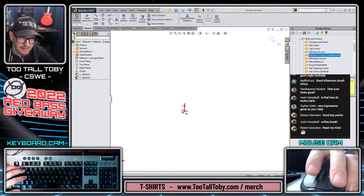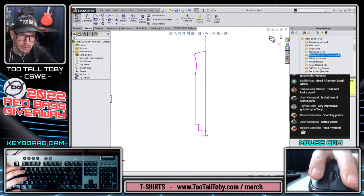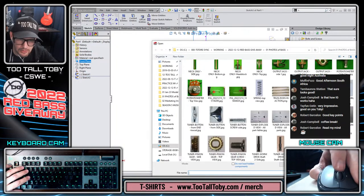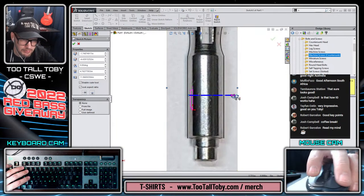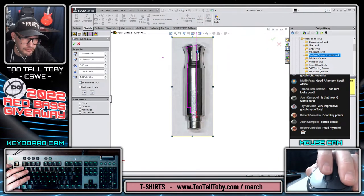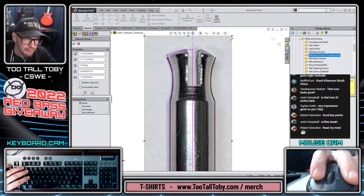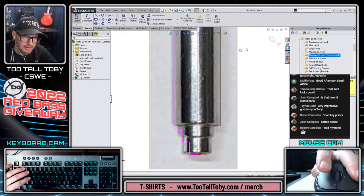Okay, so let's take a look at that image that we just captured, and bring that in and drop it in here. So tools, sketch tools. Sorry, we're gonna begin a new sketch on the front plane. So front plane, begin a sketch, orient our view. Tools, sketch picture. And we're gonna go down to that tuning post. There we go. And we're gonna use it to help determine the, what was it, 0.380 or something like that? I forget what it was exactly. Uncheck that option for enable scale tool. And then we can resize this just by grabbing the edge of it, resizing this down like so. Resizing this up to the max height of our design, which looks to be about there. And that should get us pretty close to what we're trying to accomplish with that sketch.